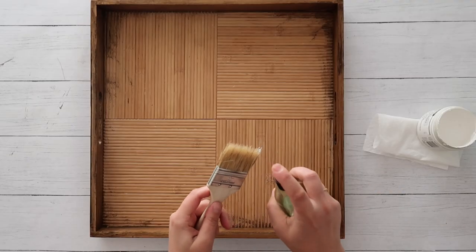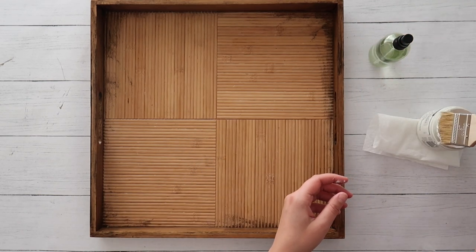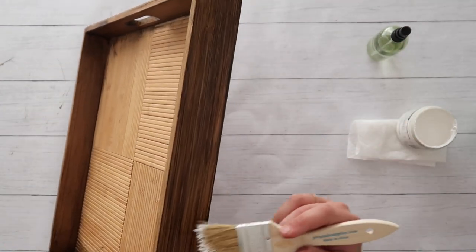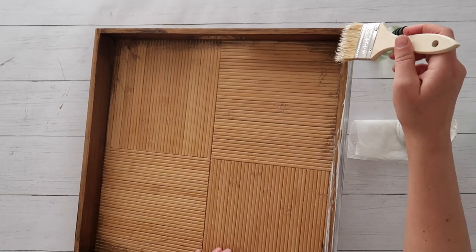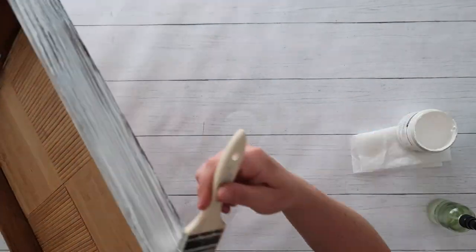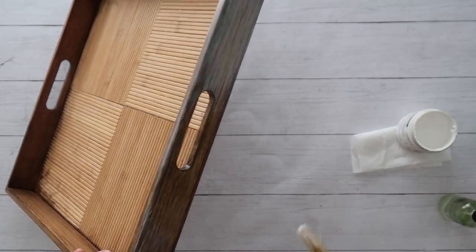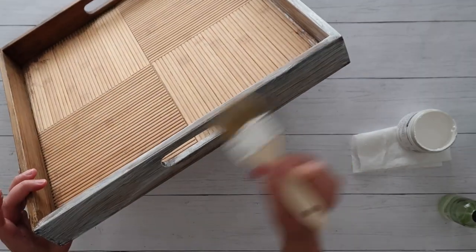So then from there, I used the same two-inch chip brush and some plain white chalk paint that was really, really watered down. Put like the tiniest bit of paint on the end of the paintbrush, then grab a spray bottle and give it a few spritzes with water, and then gently brush back and forth. This way you're going to kind of whitewash and distress the wood. It doesn't really need to be perfect, but I prefer to use long strokes like the entire length of the edge of the tray. And if you get too much paint in any one spot, you can go back with the brush, pick up some of that paint, and spread it onto another area of the tray.